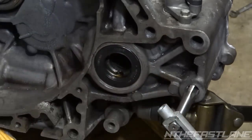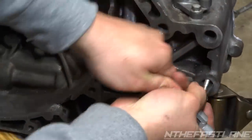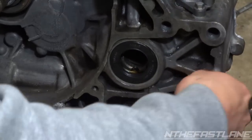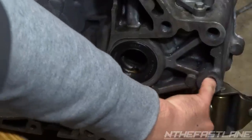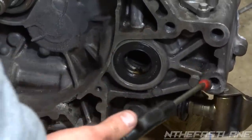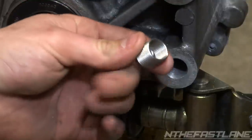We're pretty much all the way in there, so now I'm going to back it out. You can see we're starting to get some really nice taps in there. Pull it all out again — wear your goggles. Our hole is tapped out really nice and clean, and we're going to take our helicoil.